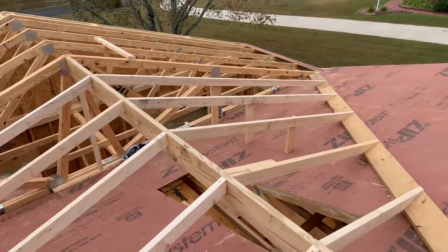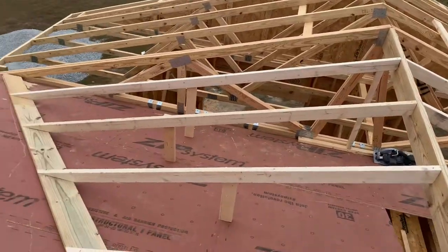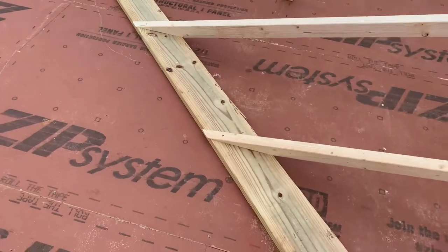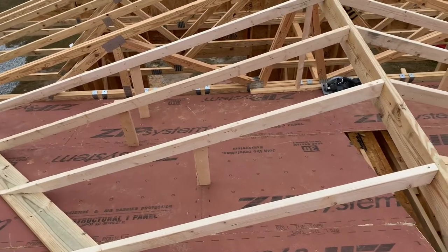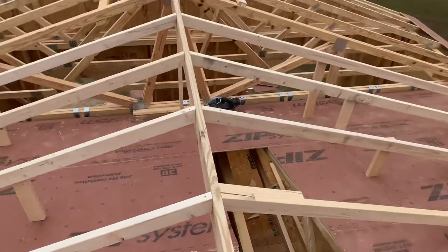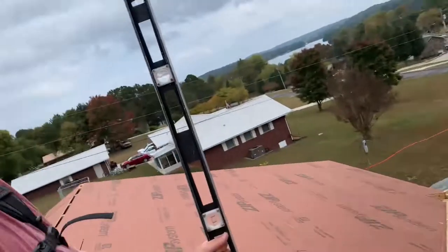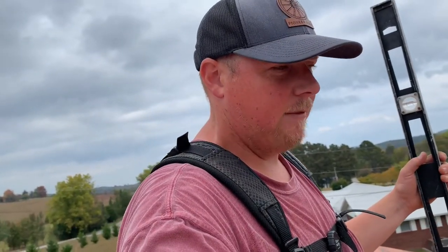Just to recap what we've done here for our valley trusses and rafters: we've come in with a ridge beam, planed into our existing roof, came off with some jack rafters sitting on top of a sleeper or a valley board. We also threw some jack studs under our jack rafters and cut a scuttle hole so that we have access to this portion of the roof or attic space once everything is sheet-rocked and the sheathing is on the roof. Everybody needs to have access everywhere or the inspector gets mad — and how would you get insulation in there if you don't have access? That's all we've done. It's time to start cutting the sheathing and putting it on.